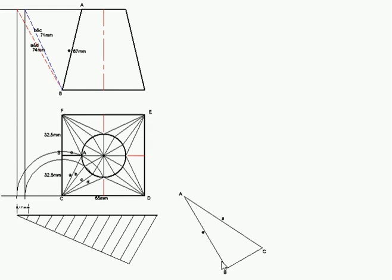From point B then to point C, I make myself an arc. We know how to do that from previous drawings that we did, where we had rectangular to rectangular or straight-sided figures to straight-sided figures and not circles. It works in the same manner. So from point B to point C is 32 and a half. I make myself an arc. We've worked out the length of A. The length of A was 74. Put my compass on A, make myself an arc to get point C.